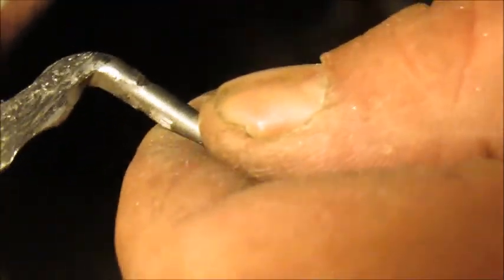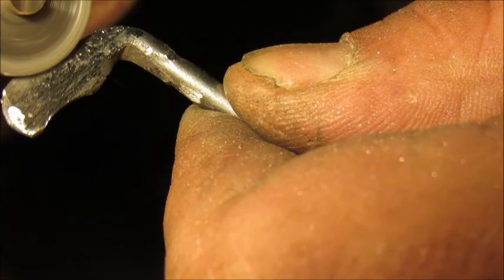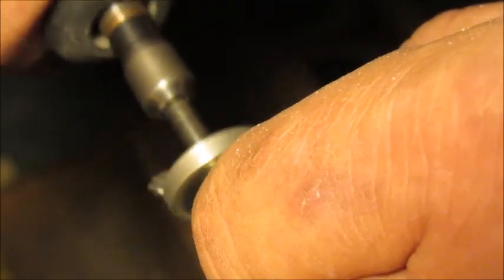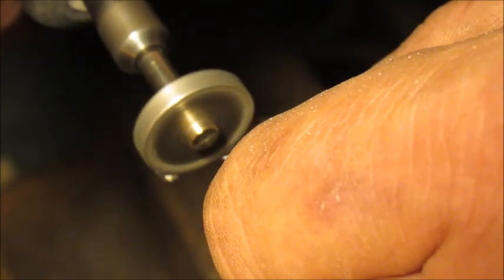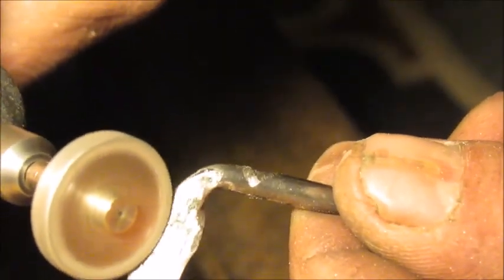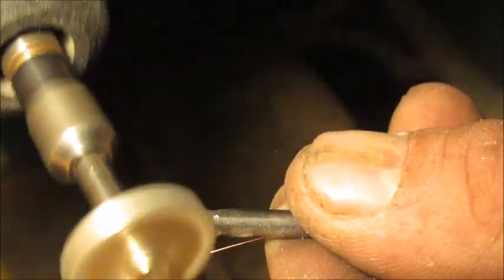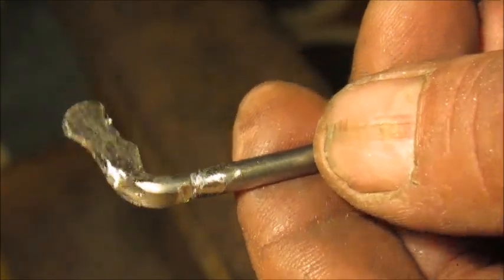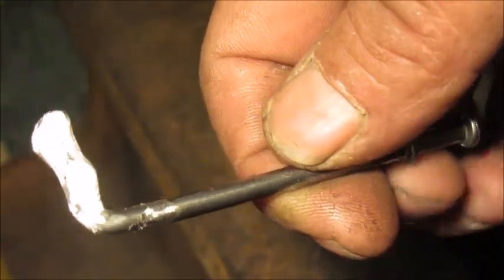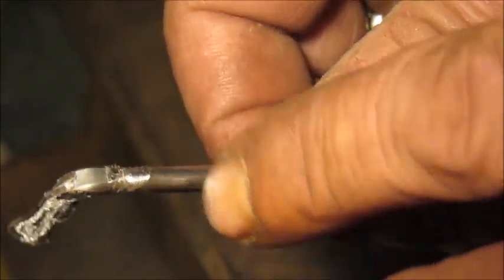You guys can see it — you can sit and file it, you can sand it, you can manipulate it any way you want. I'm just showing you the basic way I'm getting the shape and how I make it look like a little axe. Sand it all up, then sand it down with sandpaper. Basically that's how I'm getting my little axes — that's how they're built. Not too hard. Make sure you've got a little groove there for ending your wire wrap on. Then I always go back when I'm done and sand a little bit with a piece of sandpaper and clean it up.